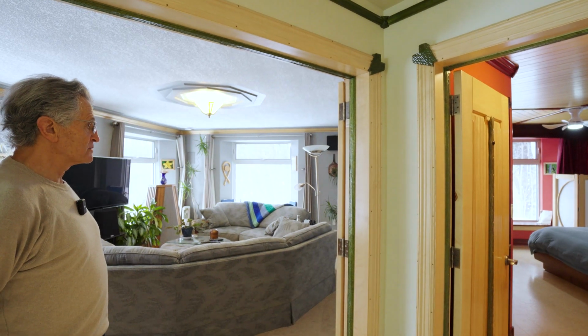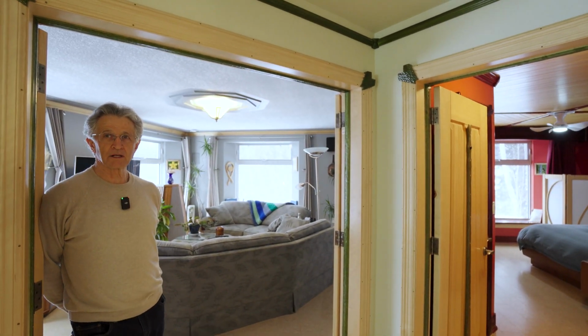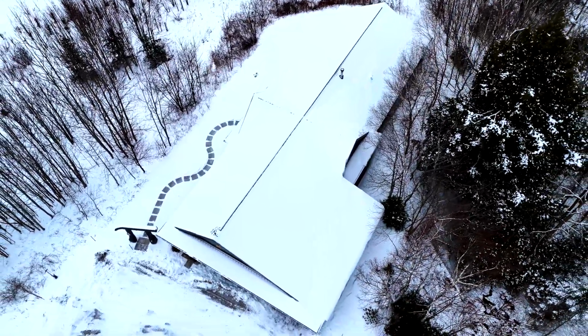And sometimes I have to really go outside and check, is it raining? Because I can't even hear the rain pittering on the roof, the steel roof. That's because the attic has 24 inches of cellulose. Yeah. That's our R80 in the attic.